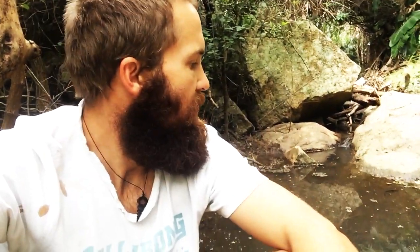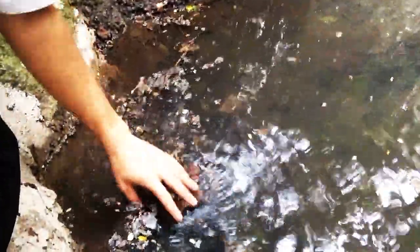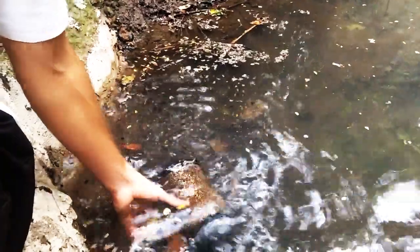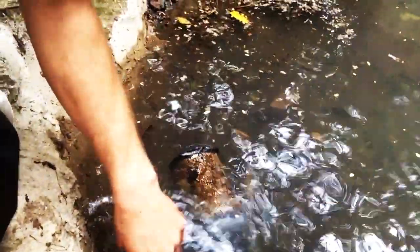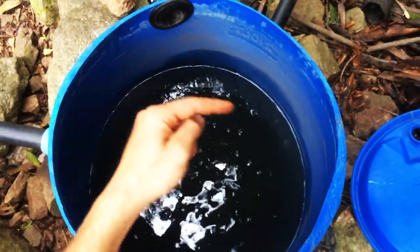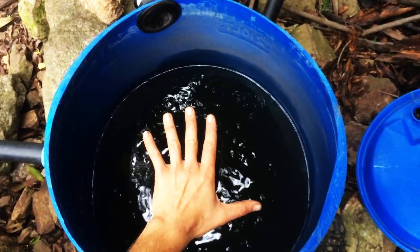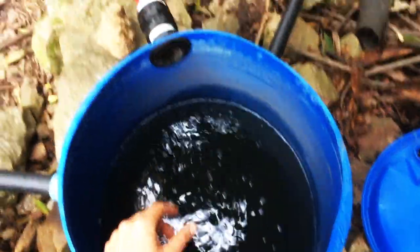This is my stream, the top end of it where I have access. We've built some more robust walls in here. This pipe here is my ram intake, and this filter cap is just an old air filter from a double cab — I pulled all the cardboard out and put it on. My pipe comes through the wall just over here and goes to that blue drum. The weir's water comes in here, got a little elbow to make it go around — it's my aquaponic background, I always want to make swirl filters — and then the ram pipe comes out that side. Currently the water level at the stream is equal to this, and when you get strong flows that water level will come up and go out that outlet pipe and back into the stream.